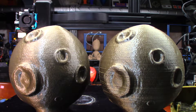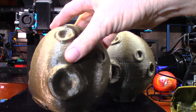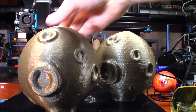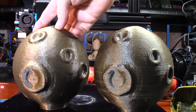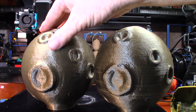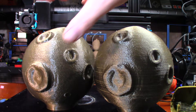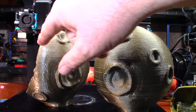I hate you Calvin — just kidding. He was right. At 0.2 layer height I'm seeing some lines but nothing like they were before. This one has definite layer lines; this one is way smoother. You can see more of the detail and the roughness the way the moon is supposed to look on the STL file. This is the way it was supposed to look — definitely way better.